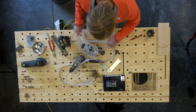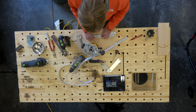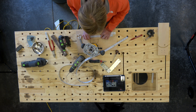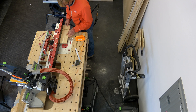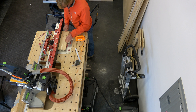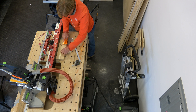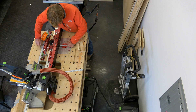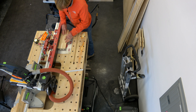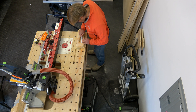I didn't put the tape measure in the SketchUp design but I decided to add it — I thought it'd be a lot easier than measuring every time. I wanted to make a very shallow dado for the tape measure to drop down below the surface. Since I had cut the angles on the side I screwed on a temporary piece on the base so it had a straight edge to go up against the router fence. I made the first cut and since the tape measure is a little wider than the blade, I used the micro-adjust to move it over a little bit and made it fit the tape perfectly.